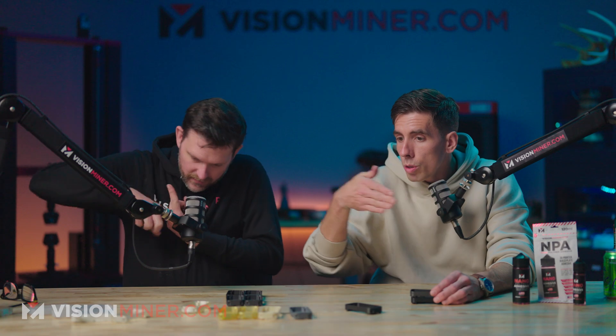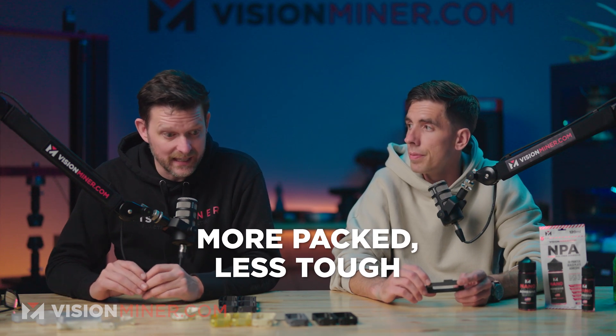There's also EPACF behind us — it looks really good, probably because they use milled carbon fiber powder rather than chopped. Be warned: if you're buying a PLA that's carbon fiber, you likely just have carbon fiber powder in there. It gives a really nice finish, but in terms of strength it can actually weaken it, creating more voids and less adhesion. When you get chopped fibers, they go through the material layers and act like a skeleton, which is why you get more rigidity but also more brittleness at higher fiber percentages. You have to be careful feeding it into the machine — if the filament bends too sharply on the way to the extruder, it'll break.